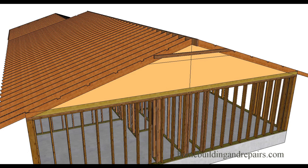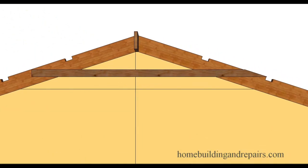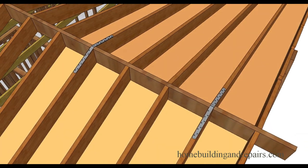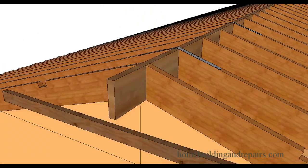Our example here shows a 2x4 and a 1x6. Even though a 1x6 is allowed, it could be a problem — if you have a 16-foot long 1x6 for your collar tie, I think I would rather have a shorter one. I like to put collar ties right underneath the roof ridge when I build a conventionally framed roof. If I don't use a collar tie, I'll use a strap. Straps are 48 inches on center maximum — so with 16-inch on-center rafters, you'd have positions at 16, 32, and 48 inches.